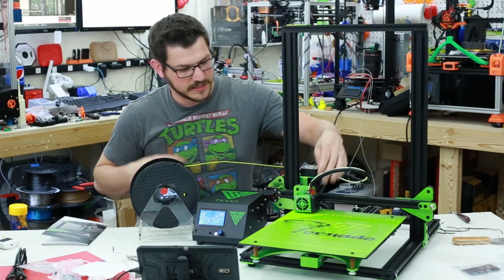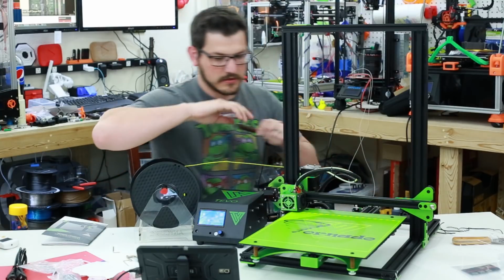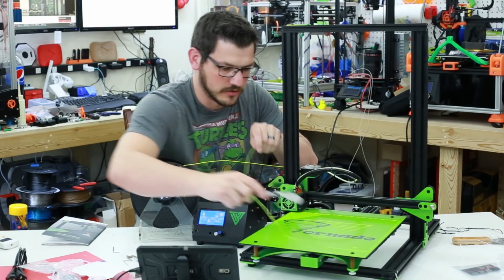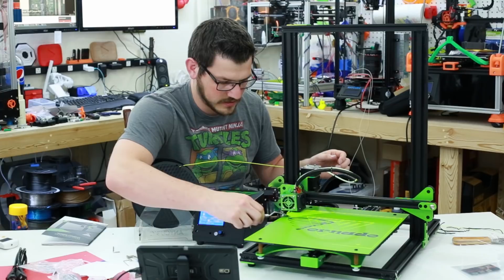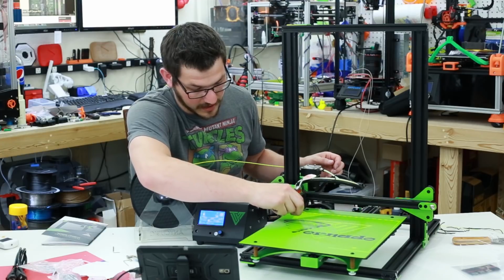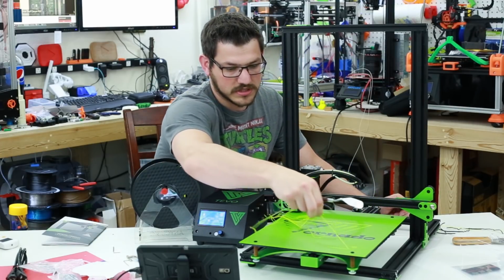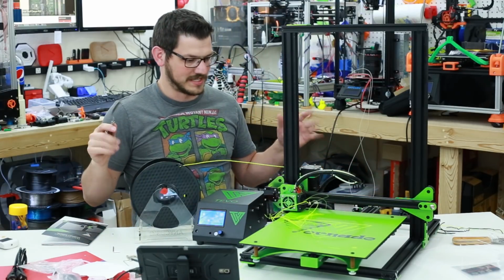All right, so the Tevo test is the exact same one that came on the build plate when I got it. I was able to do some live adjusting to get it a little bit more level. I was a little bit close here on some of these parts, so I have to work on scraping this all off now. But this stuff sticks. You need to keep yourself a high offset from the bed, because it sticks like it's nobody's business, and it's so hot for this PLA. It just wants to get real stringy when pulling it off, kind of like bubble gum. So this is going to be a little bit of a challenge to get off.